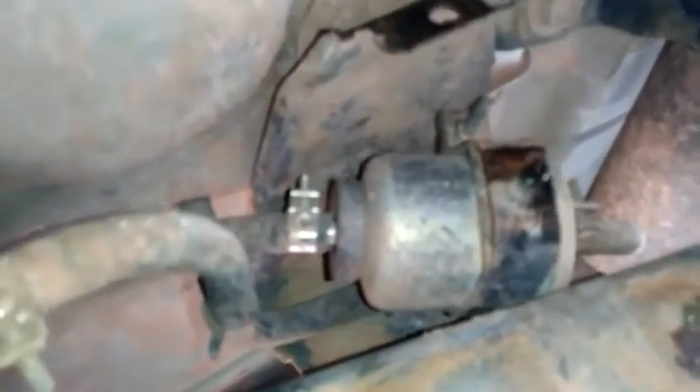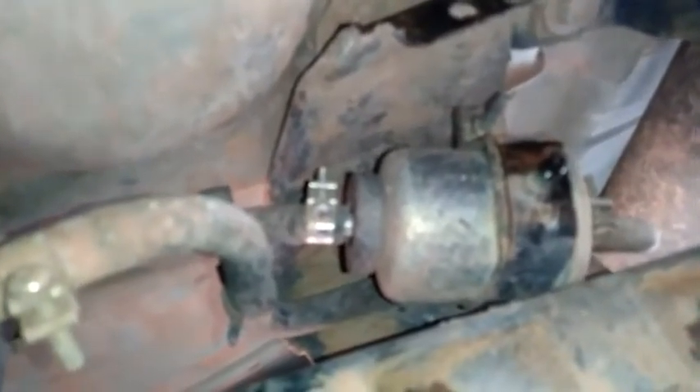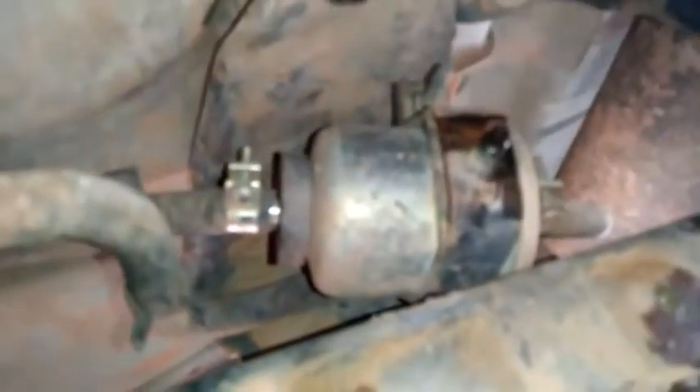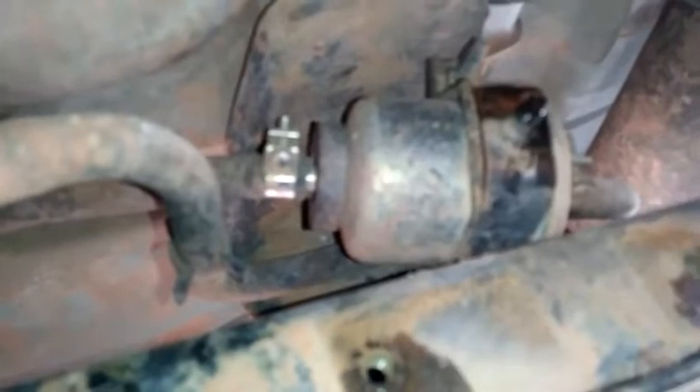You can see we have a magnet on the sump side of the filter, and that's for holding back any corrosive elements inside the steel gas tank. If we had a plastic gas tank we wouldn't need that magnet, because there would be no corrosion for the filter to trap.